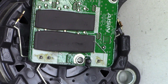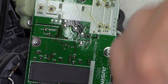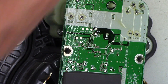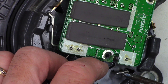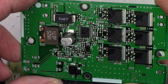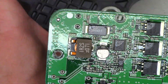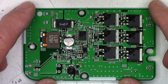Pretty happy with that. Let me find a small Phillips screwdriver and we'll see if these guys will give up peacefully — don't want a messy divorce. There's quite a lot going on in here. There's what would be an H-bridge FET assembly, and a three milliohm resistor for current limiting purposes, obviously.